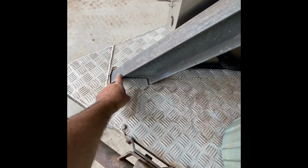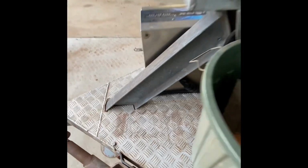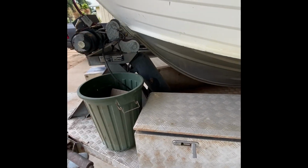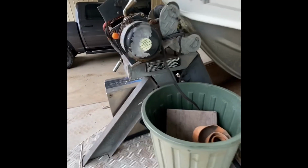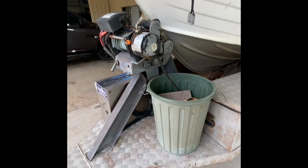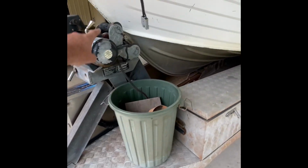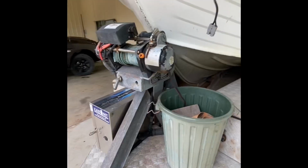Manufacturers secure this with U-bolts so it's adjustable. On dirt roads, going through gullies, they continuously break. If you want to build a trailer that is totally robust and will not fail, that has to be fixed, welded, gusseted. So this boat does not end up in the back of your car when it's loaded.